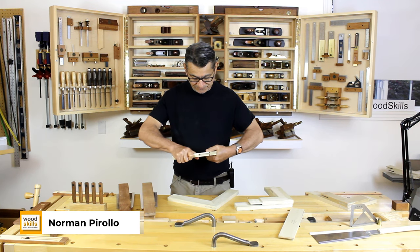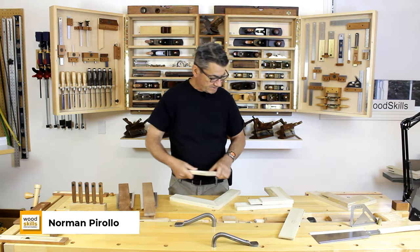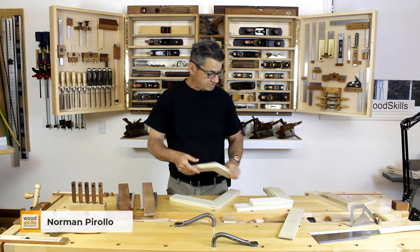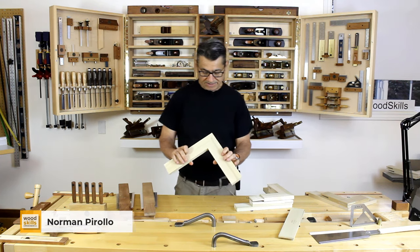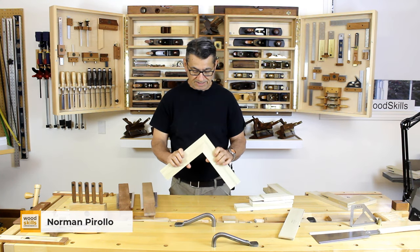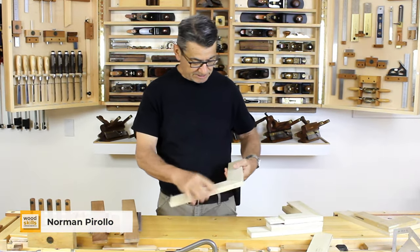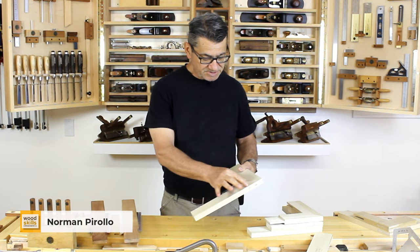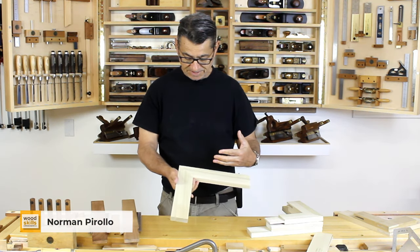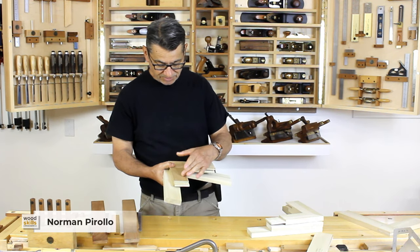Here are some other examples — they fit fairly tight and it's just a matter of gluing them up. I haven't glued some of these up yet. This is the actual one I'll be creating today, and this is the actual end result, already glued up. You can see the grain flow is very aesthetically pleasing as it wraps around — that's one of the features of the mitered bridal joint. It utilizes the mitered joint so there's no abrupt change of grain from a vertical to a horizontal surface as in a conventional bridal joint.